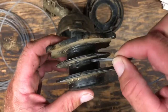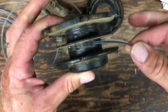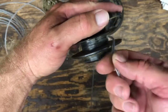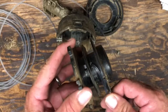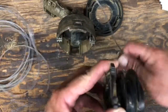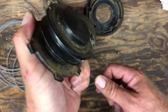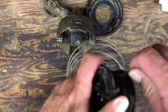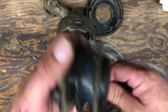This is how you wind it. Put the line in, push in as far as it'll go — it'll only go in about a quarter to a half an inch. Now it's in there. This is the part where people get confused: take the line, bend it backwards so it looks like that. Bend it backwards, then begin winding it that direction. When it starts to get a little tangled on you, hold it with your other hand with your fingers like this. Stretch the line out, let that fall loosely. Begin to pull it, keeping this tight the whole time — because what you want to do as you're pulling it is take the twist out of the line.